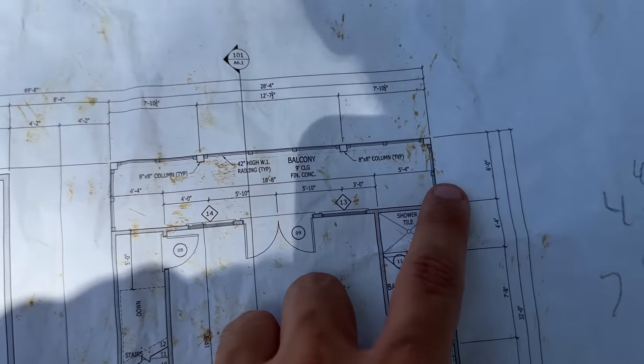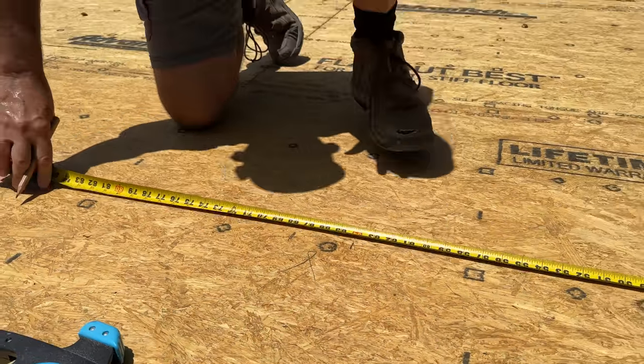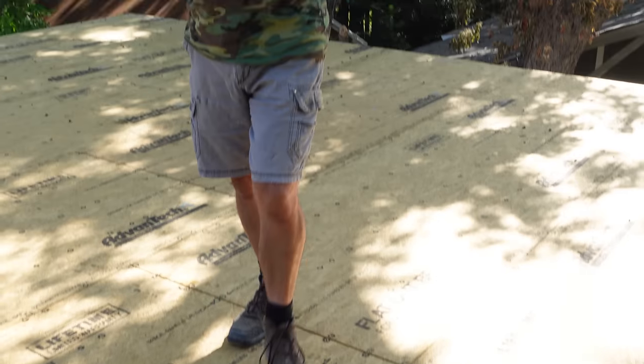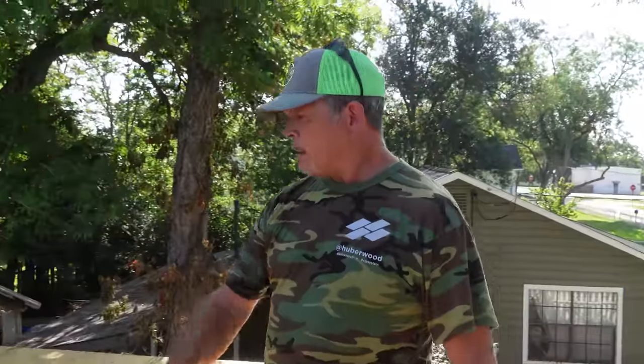Jordan, what's the width of your bathroom? Five feet four inches from the exterior wall to the interior wall. We've got all our chalk lines laid out and we made two modifications to the plans on the fly — a couple of two-by-six walls we'll explain later. Rad is downstairs with our pre-cut studs cut for nine-foot ceilings — no cutting to length required, a big time saver. He'll toss them up and we'll build our very first wall on the second floor.